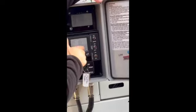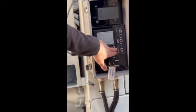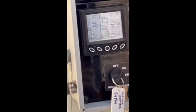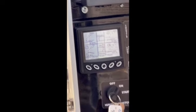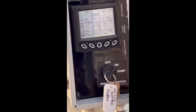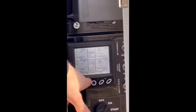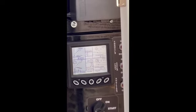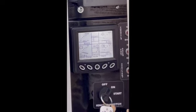No, there's functions in there, guys. It's not the end of the world. But that's going to control our auto feed settings. It's going to control our track speeds. So if you take this out, you're tracking it a mile down a straight road and you notice it's pulling one way or the other, you can get in and adjust the percentages to increase your right track or your left track, that way it goes straight. Also, we're going to adjust our feed speeds in there, going back to feed speed 1, feed speed 2, feed speed 3. That's where you'd control it from. So we'll go over that at the end.